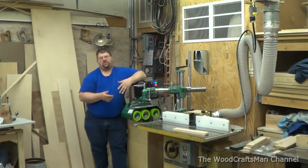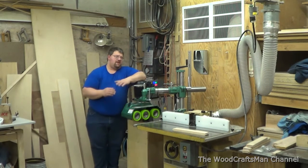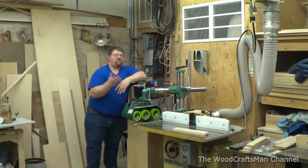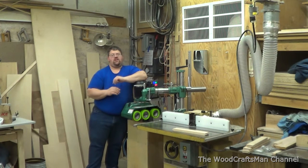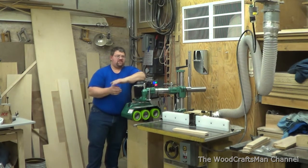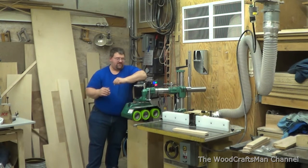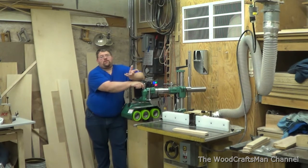Basically, I'm just going to share with you the process of how the doors are made here, and it's 4 separate processes, but we do it on 3 separate shapers. The normal way of things, people would have 4 shapers set up for the 4 processes, but we've taken 1 shaper and set it up to do 2 processes with basically no adjustment in between, which is nice. So in this video I'm going to show you the machining process, the assembly, and then the outside perimeter profile process, and that's pretty much it.